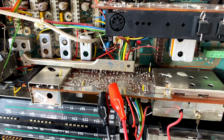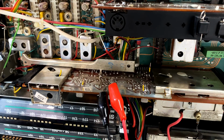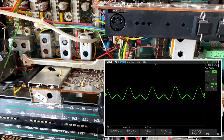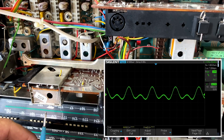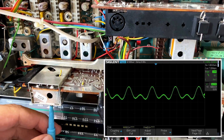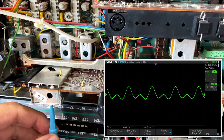And what I've done is I've injected a 10.7 megahertz signal, and I'm injecting it there, and I'm modulating it with an audio tone. I've got 600 hertz at 50 kilohertz deviation. And I'm going to adjust this thing till I get a pure sine wave on the screen. See what happens. See if this thing is anything like what I expect it to be. We should be good.